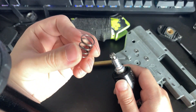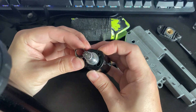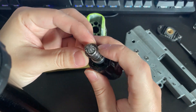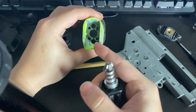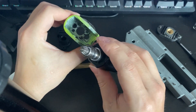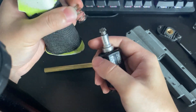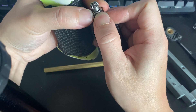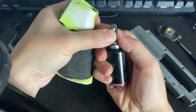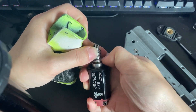Then I enlarged this side of the spring. When you put the spring on regularly and insert it into the hole, it can get jammed on the side of the motor neck and impede the motor, actually causing it to tilt — pushing it to one side because the spring gets jammed on one of the legs right here. So I made this side of the spring opening bigger — the side that goes into the grip.